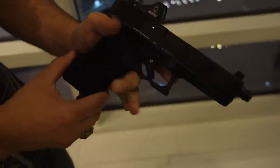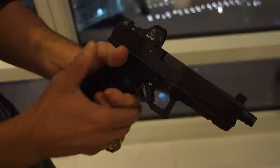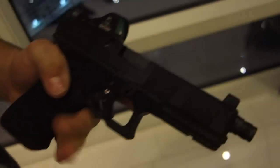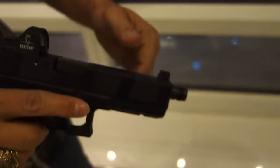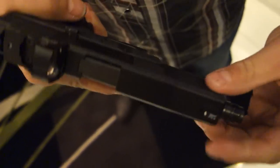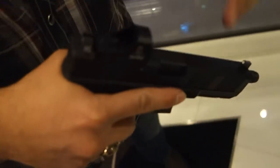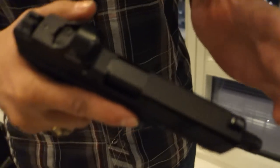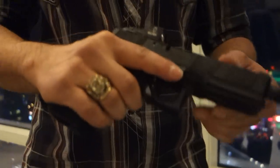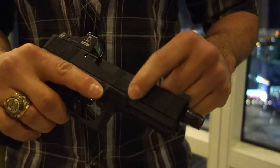It makes a ton of difference over just a standard Glock grip, which would be right about here, and then your support hand would be right about here. Right, and then for racking the slide, instead of serrations, you have that same stippling up front. That's right. For our slide modification, we take 45 degrees off either side. That kind of frames the sights, and what it also does is we're able to lose probably about 25, 30 grams, so almost an ounce off of weight there. And then on the slide itself, we mill into the slide. That's probably about 25 to 30 thousandths deep.